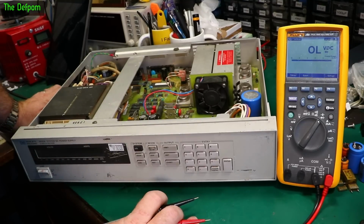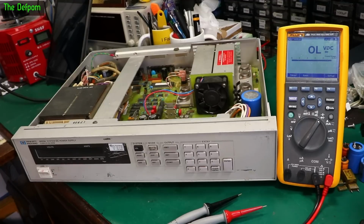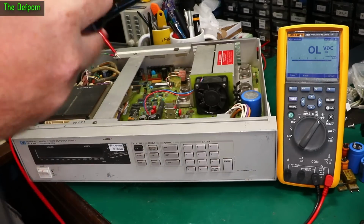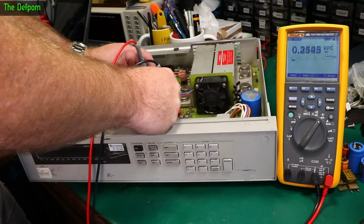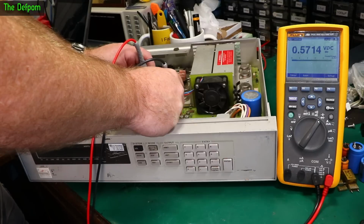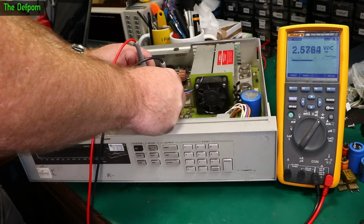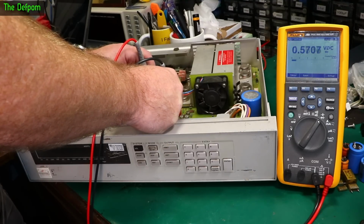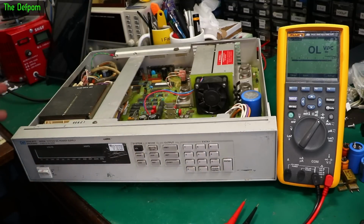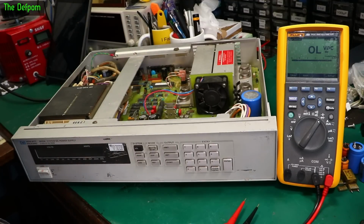So that's U101. U104 I can only check one pin on. So there's nothing obvious there. U101's the one I'm interested in. It's definitely strange it's blown. Let's do one more check here on these diodes. One of them will be normal. That's just a charge up cap or something, that's fine. Yeah, that's all good. Can't find the actual faults there. I don't know what would have blown up. That's very interesting. I think I just need to replace the things and let's see what happens.